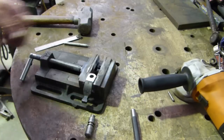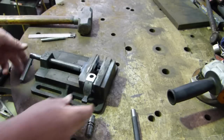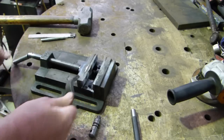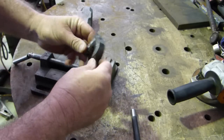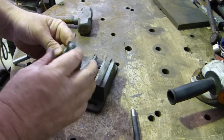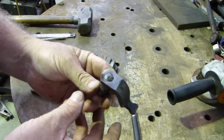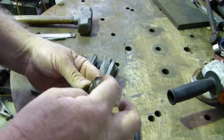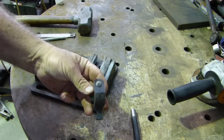There's the tools of the trade - the angle grinder. My main grinder on the bench, the capacitor's buggered up again and it doesn't want to start on its own, so we've got the angle grinder going. We'll sit this little fellow in there once more and line the witness marks up. And there's actually some sticking out, which I didn't think would happen. So that might be why it broke - there wasn't enough body of weld down in there. By the time that little double weld on the top of that, yeah, there wasn't an awful lot holding it, was there?